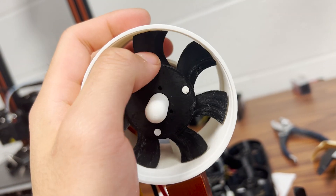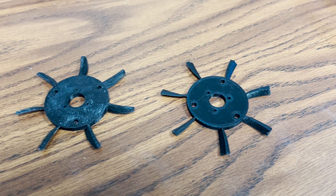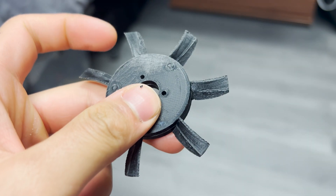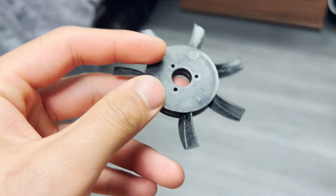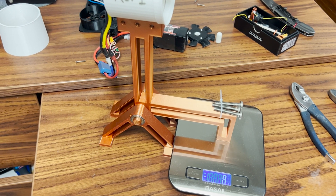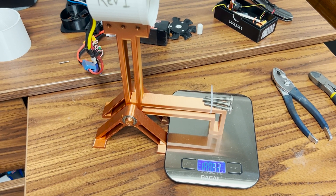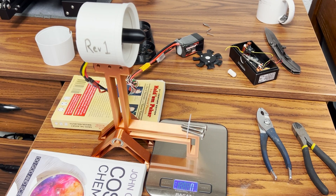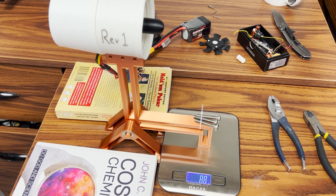With my last propeller, I was getting crazy turbulent airflow, which caused a bunch of noise throughout the entire testing rig, so my goal for the next iteration was to make something a lot more thin. Here's a more muted 7-bladed design where I used the printing-in-half method. I also oversized the prop and ran it inside the duct to get a really small fan gap. The tests were decent at around 60 grams at 30% throttle, but around this time I noticed how unstable my testing rig really was — you can hear and see the vibrations as it slides around. Adding weights plus an inlet lip brought performance up significantly, and adding a converging nozzle ended up achieving a record of 90 grams.